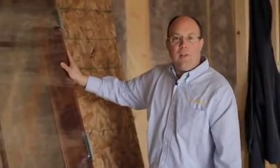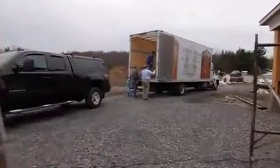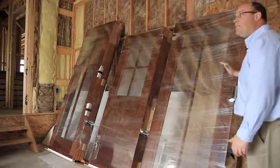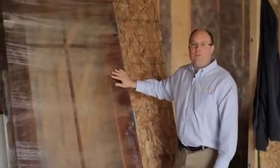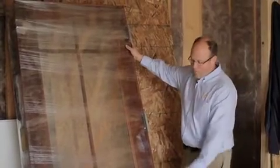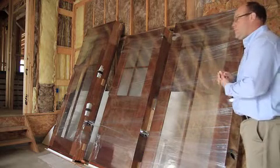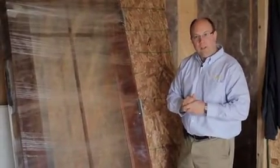Something to discuss is when you get the door, where do you want to set it? This door here is pre-finished, so everything's sealed. We're in a garage here at a job site. If you have a product that's unfinished — and a lot of our product is unfinished — we definitely don't recommend leaving it in the garage, because the garage is generally a non-humidity-controlled place. We would definitely recommend putting it into an area that's temperature controlled and humidity controlled. We recommend having it finished within one week after it's installed.